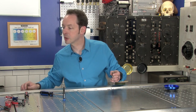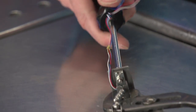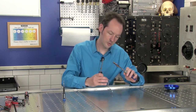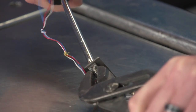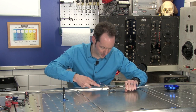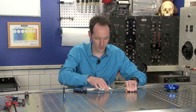Now the middle bar has — we're going to dig right into this. Let's just take this apart and see how much we can see. I need a pair of pliers. These are exactly the pliers I need for this. They're even adjusted right. That's in there for serious. Now the load cell measures — there's a couple different ways these work. Sometimes they're piezoelectric and they have like a quartz crystal. Sometimes they work with different types of conductors where it's measuring the resistance under tension or compression or something like that. It varies — there's a couple different ways to make a load cell.